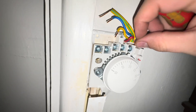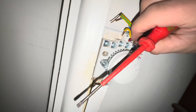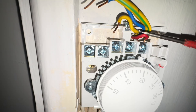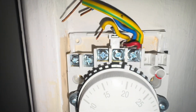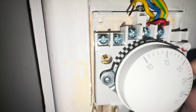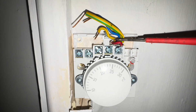Now I'm going to pop the cables back in. We'll start with live — might need another hand for this. Get that in there, hold it down and screw it in. Now switch live goes to terminal three. So that's when you hear the click — this would be off, and when it clicks it sends signal to three, which fires the boiler.